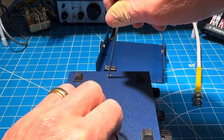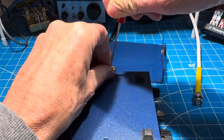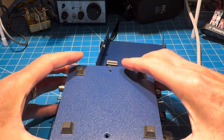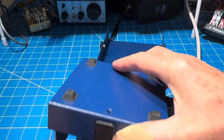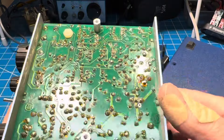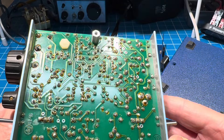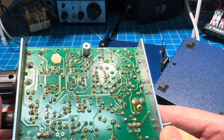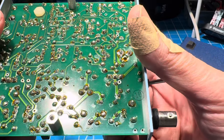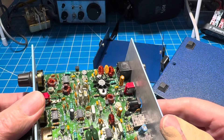These are really convenient to look at — there's only two screws to get the bottom off, and it leaves the front and rear panels in place. It looks pretty clean. A little flux here and there, but I don't see any glaringly bad solder joints. And always the best news is right around the final output transistor — it looks like it has never been changed. So I think we're probably in pretty good shape to have a radio that works.